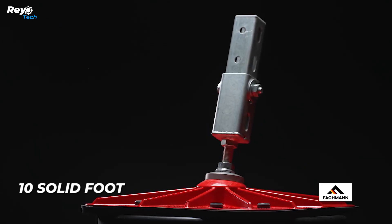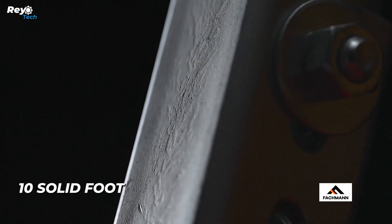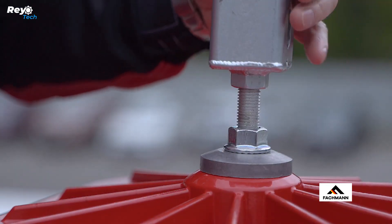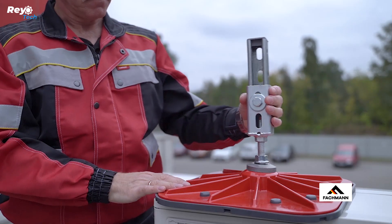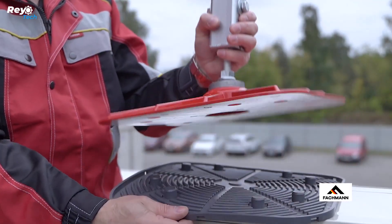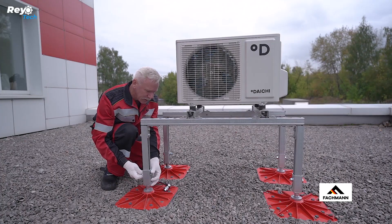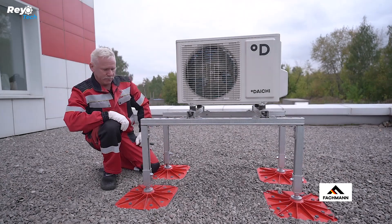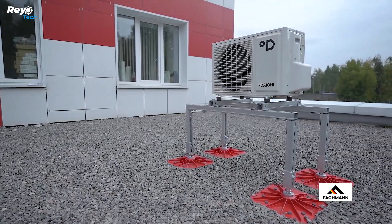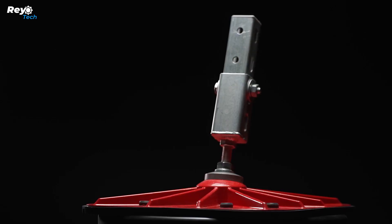Number 10: Solid Foot. With strong foot supports, it is easier to place something like an air conditioner on your roof without causing harm. Each support can sustain up to 2 tons and distributes the weight of goods such as the AC outdoor unit and other parts efficiently. These roof supports are installed without the need for drilling or any further work, and they can compensate for slope angles of up to 8 degrees. To minimize slipping and denting, workers frequently supplement the supports with thermoplastic elastomats.